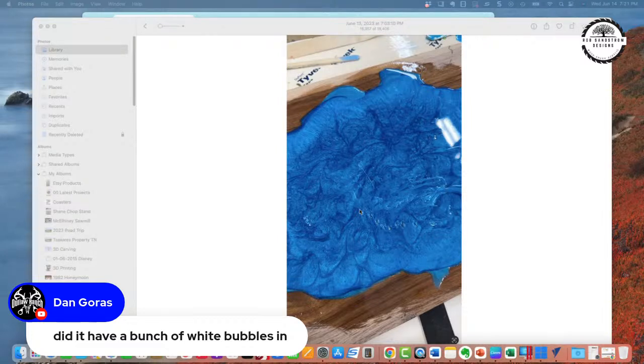So it was curing not efficiently or evenly. It was curing in spots and not in other spots. And when I went and checked the temperature in my garage, it was up to 85 degrees, at least on the thermometer that was a short ways away from that pour. Normally, I like to keep it under 75 degrees. I have a mini split to do that, and I just forgot to check the temperature. And it became obvious when this thing started curing way too fast.